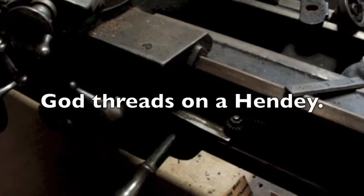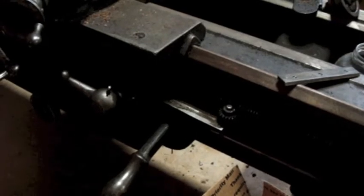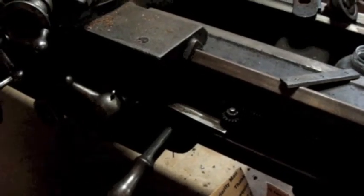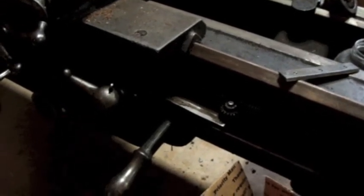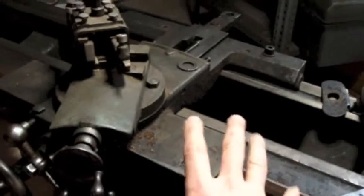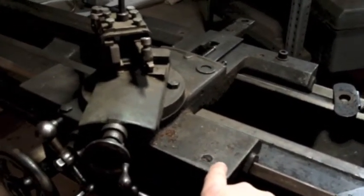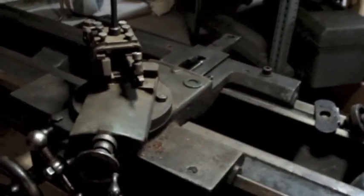But he did grab off the U-shaped piece for the tapering jig, and he took measurements for me, and the bolt spacing indicated that it was going to be too big and would not fit on my lathe. So that basically confirms what I've already come to learn, which is that the 16-inch version of this lathe has a much bigger carriage, so it has a bigger tapering jig on it, so those pieces aren't going to work.